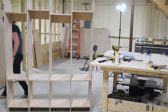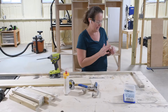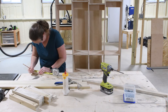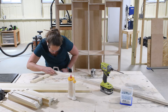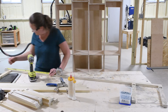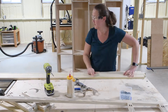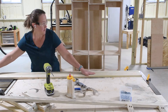With the cabinet build finished, it was time to build the face frame. The face frame is really easy to put together but it is large, so you want to make sure you have a large flat surface to assemble it on. The face frame is made up of rails and stiles — the rails are the pieces that cover the front of the shelves, the top, and the bottom, and the stiles are the vertical pieces that cover the sides and all of the separators between the lockers. You attach pocket holes to all of the rails and then it's just a matter of attaching it all together.